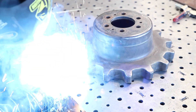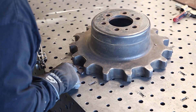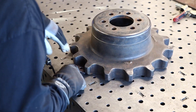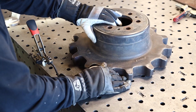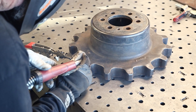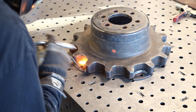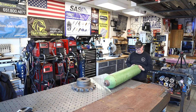You can see those tabs fit right in between the teeth. I'm putting one in about every third tooth and welding around. They stick out just a little bit beyond the end of the teeth — I planned it that way to have a little room with the half-inch hole for the bolt head to fit on easily. Once it's bolted to the ground you won't really see that sticking out. I welded them from both sides — top side all the way around, then flipped it and got a weld on the bottom side as well.